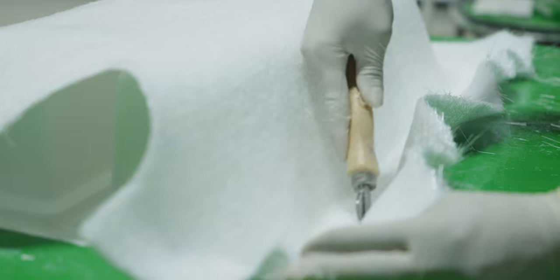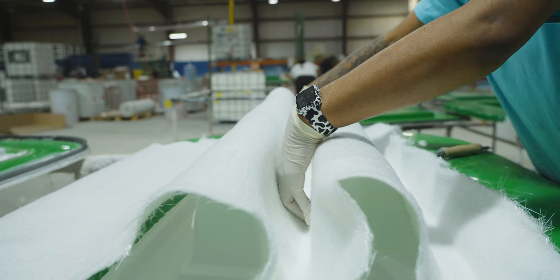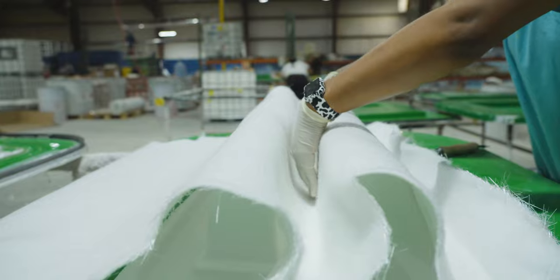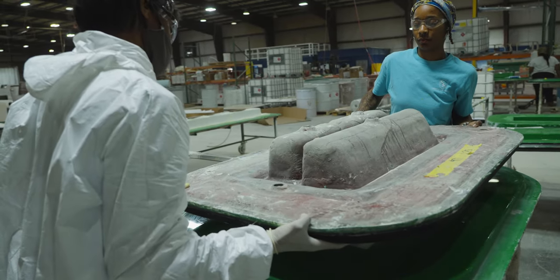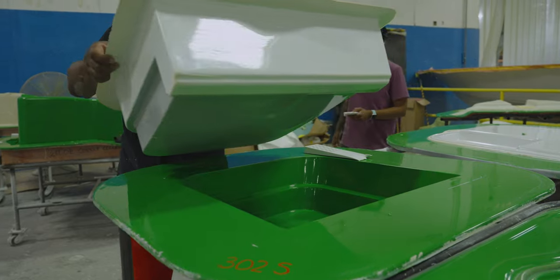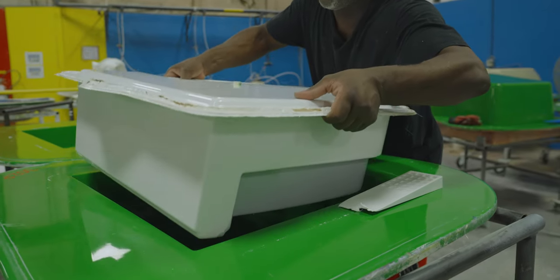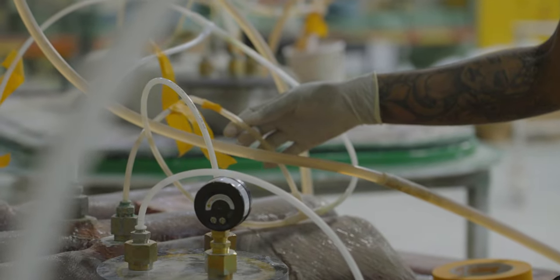Using an A and B mold, the cavity between the two molds can be closely controlled to achieve repeatable, uniform, and predictable thicknesses. This is a key to alignment, fitment, and finish of the parts in the assembly room. Lastly, light RTM has virtually no waste. Unlike the infusion technique we discussed earlier in the season, the molds are reusable, and other than the hoses used for resin, there are no consumable materials.